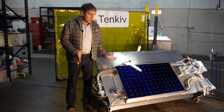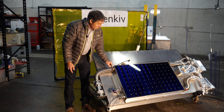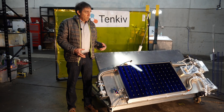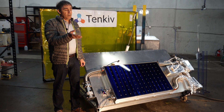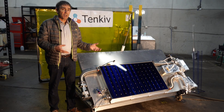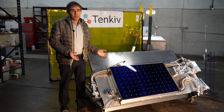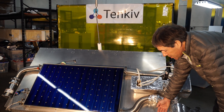The final version of the panel will be set up somewhat differently from what you see here. They are designed so that with multiple panels, the next panel simply butts up and automatically connects flush to the panel next to it. We designed it so that 10 panels in a row have big enough connections for adequate flow without an external manifold. Right now we're using an artificial light source, which is ideal for testing because it's a much more controlled light source — the sun is always moving, clouds come and go, so we use artificial lighting of exactly known intensity that stays constant for the duration of our tests.